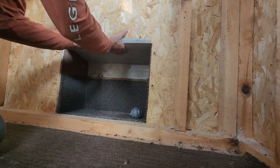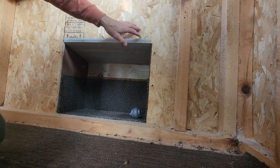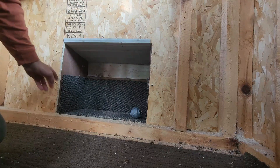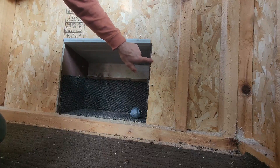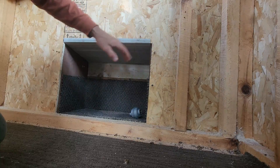Back inside, I'm going to make sure the cubby is pulled tight when I set the top three screws. I'm also going to put two screws down each side — those are going to go into the meat of the 2x12 that's out there. The top three screws go into that deck spindle.